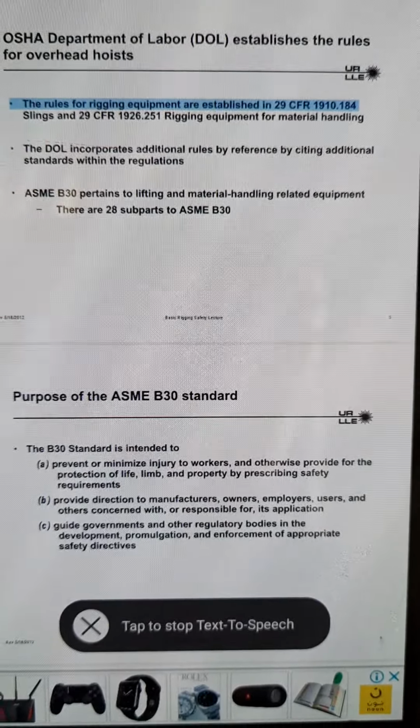Lecture 34. Eye bolts. Lecture 35. Machinery eye bolts are not as versatile as hoist rings. Fixed position based upon thread engagement makes them alignment sensitive when pulling at an angle. Can accommodate through hole applications. Load ratings are based upon a number of factors: size, ring size and thread size. Material is commonly forged from carbon steel or stainless steel. Carbon steel and stainless steel have different load ratings for the same size. Use angle: can only be used up to 45 degrees. Two different styles and numerous sizes available.